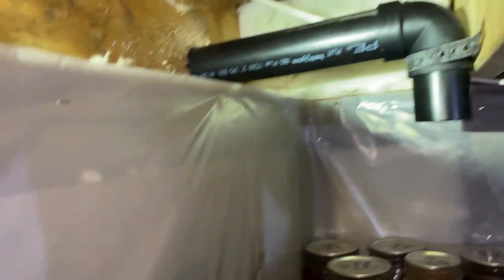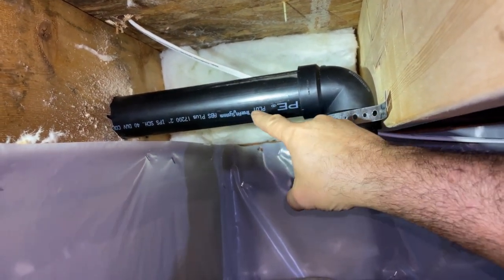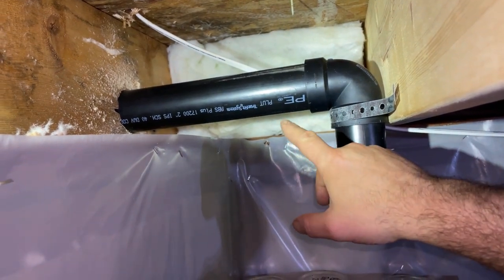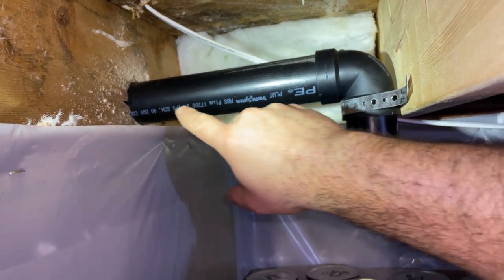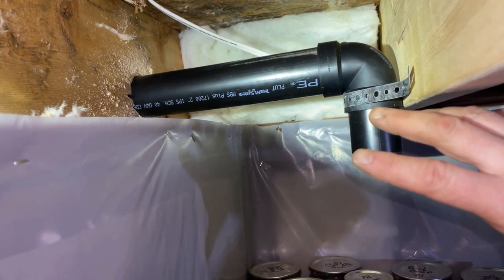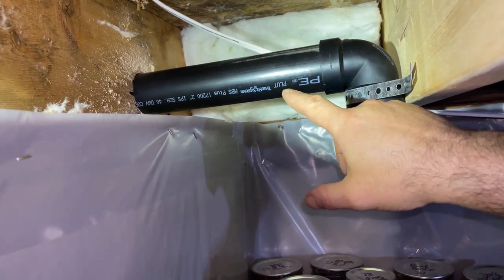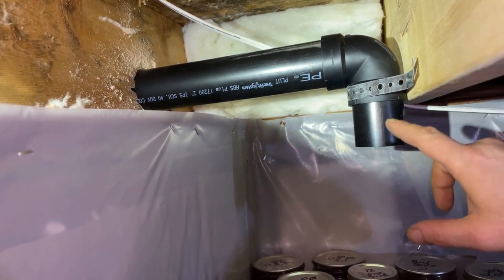That fit on there pretty nicely. I've got one more thing to show you about these pipes as you bring them through your wall — it can be pretty important. This is the exhaust as it comes in through the outside. This piece of pipe is angled down that way — I did that on purpose. If any moisture does happen to get into this pipe, it's not going to drain and drip out into your cold room. What's going to happen is it's going to want to run downhill there. The other reason this is important is that as you want to keep your humidity high in here, there's a good chance you're going to get water that could condense inside this pipe, and you want it to be able to run outside and drain out rather than freeze up or drain into your cold room.